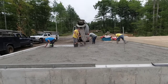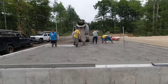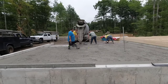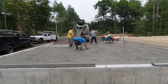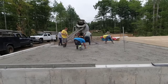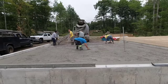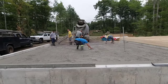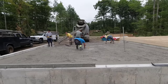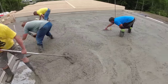The tapers work fine. One thing I like better about tapering my garage door versus the lip is there's no trip edge there. Somebody parks in the driveway, starts walking in the garage not paying attention, they trip over that. Or what if you have somebody in a wheelchair and they want to go from the driveway into the garage — now they've got to try to wheel their wheelchair up over that inch and a half lip. I know it probably works great for keeping water out of the garage, but there's other things it could make issues with too. Whereas a nice taper in your door is a smoother transition. Let me know what you guys think about that.